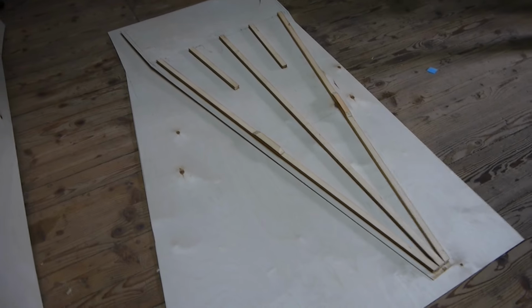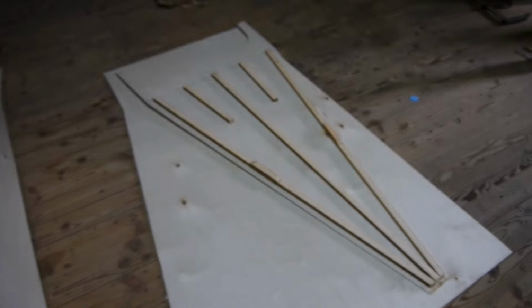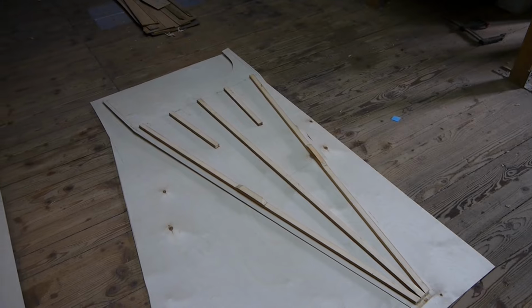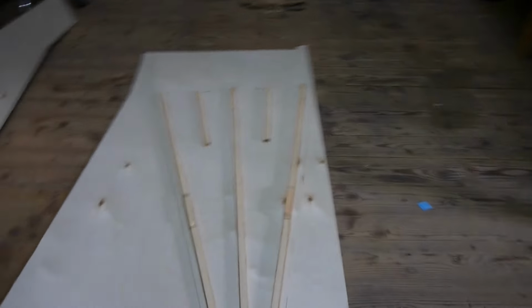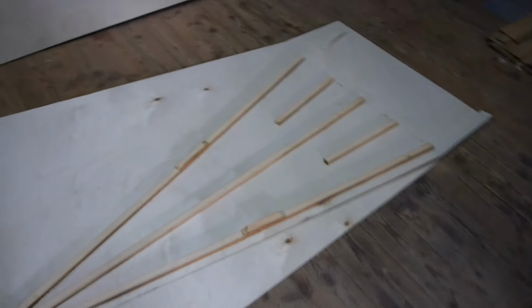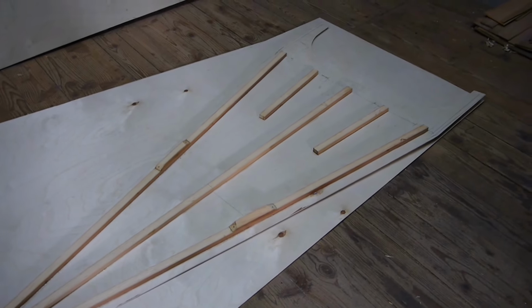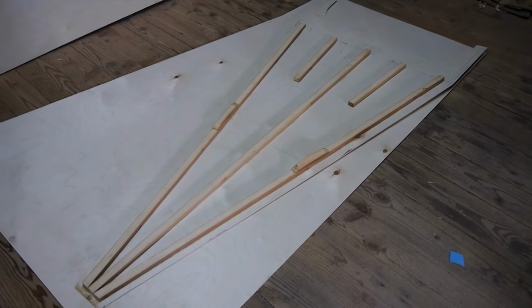And then it can happen that they have knot holes. So you have to check them yourself. And as it is plywood, that always comes in several layers, you also have to x-ray it to see if there are knot holes on the inside. Of course, you have to work around these because you don't want them in the component. The turtle decks are not load bearing, but only molding parts, shape-giving items, but you still want to avoid knot holes.